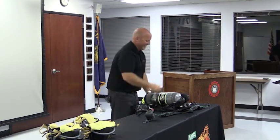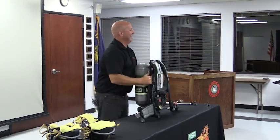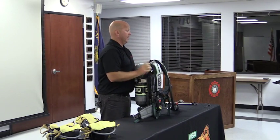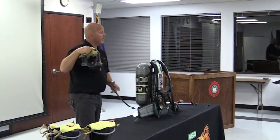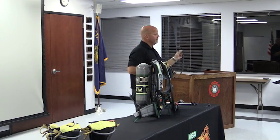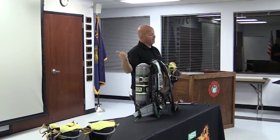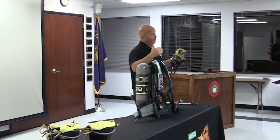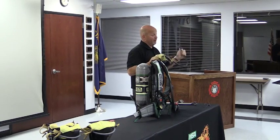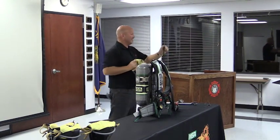I do have one thing. On the SCBA mask with the disconnect, when you disconnect that, the person in the mask, if I'm assuming they're in a victim scenario, are still sucking air through that hose. It's a check valve. As soon as that disconnects, they get one puff. You have a check valve on this end, as you have a check valve on the other end, so you're not allowing contamination in, but you're not allowing any air either. So when you make a connection or disconnect, if somebody's still breathing off of it, better make it quick. They'll suck in rubber, because that's what you'll do.